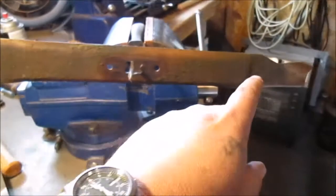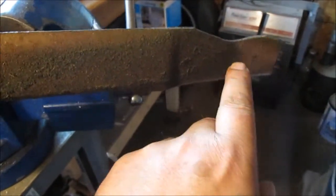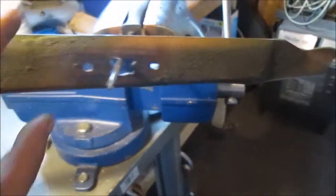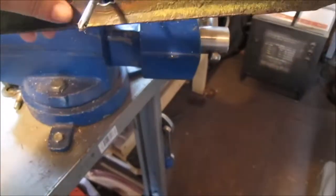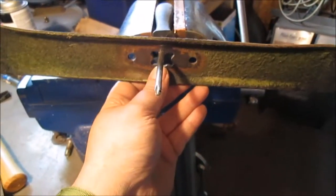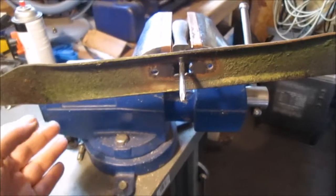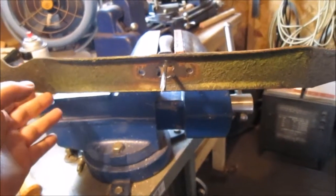It means it's heavy on that side. I always take off some metal with the grinder — see this curve? Steal some metal out of there, don't really change the shape. Take a little metal out of here somewhere. Don't take it off the edge — don't keep sharpening the edge. Let's flip it over. See, that's the side I expected to be heavy — now it's over to the left. But it's got that funky notch. I play with it. It's good enough for me, maybe not for you.